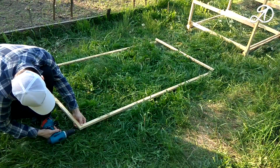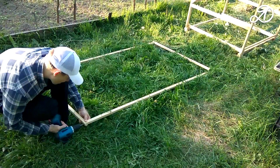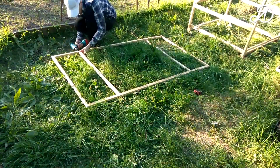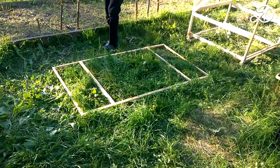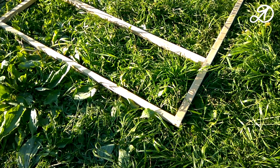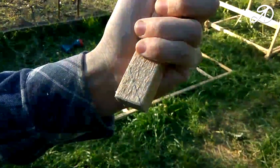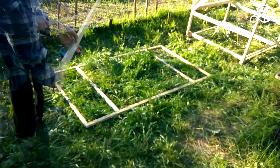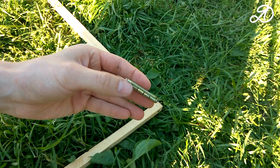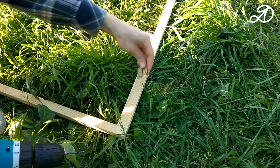I'll make a door with thin planks with a square section. It is necessary to take into account the gaps between the door and the door frame. I will make gaps of 3 mm. I'll make an angle strip the right size, but not fasten it yet. It is time to fasten the hinges on the door. There will be 3 pieces.